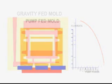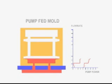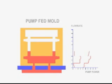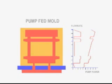To overcome this, the CMI NovaCast pump fills the mold from the bottom, allowing much greater freedom in gating design. The pump power is varied throughout the cycle to fill every part of the mold as quickly as possible without ever exceeding the critical velocity. The results are increased casting quality, reduced scrap rates, and higher production rates.